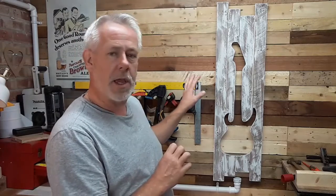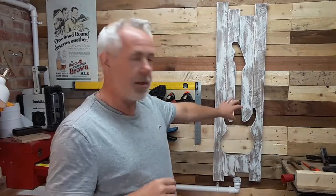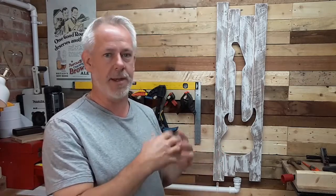I offset the heights so that you get that varied look, and it gives it that older style. The colour in itself gives it an aged look — I've stained it, painted it, sanded it and repeated that process a number of times. That gives you an aged look, along with using a sander on the edges so that you get these wavy line indents. You can use a hammer, you can use screws — anything that will dent into the wood will give you an aged effect. When you paint over it and sand it, the paint stays within the indent and you get a varied colour and different textures.